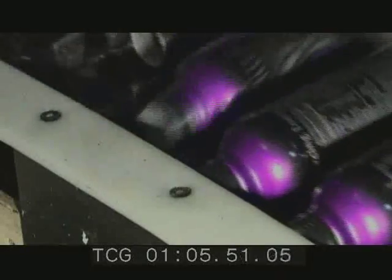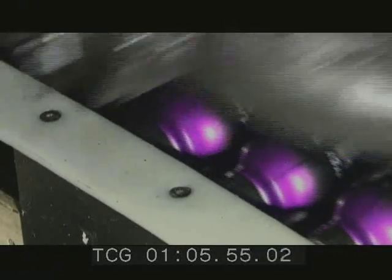If they tried to do this with a single die, the force needed to shape the neck would crush the aluminum. The very last die adds the separate plastic piece with grooves to the neck so the cap can be resealed. The finished bottles get a good cleaning.